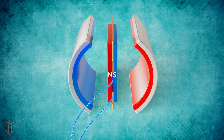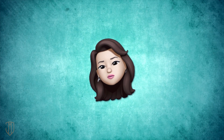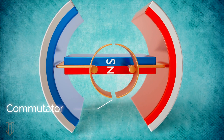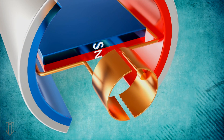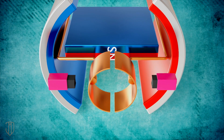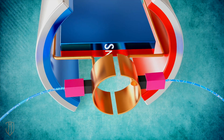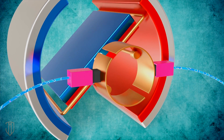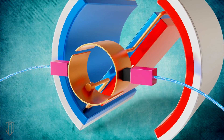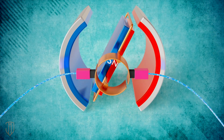The electromagnet spins until the opposite poles attract. To keep it spinning, we can keep switching the wires, but switching the wires is a bit primitive and inefficient. So we throw in a commutator — basically a ring with gaps on opposite sides. It's connected to the armature so that it spins with the armature at the same time. We connect the commutator to the circuit using two brushes on its sides; the brushes have springs so they maintain tight contact. When the commutator spins, the brushes slide along its side. Each brush touches the opposite piece of the commutator, and after passing a gap, each brush switches to the opposite side — effectively like switching the wires. The result is that the current flows the other way, which switches the electromagnet's polarity.